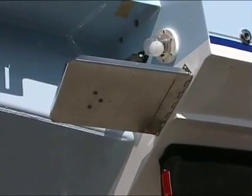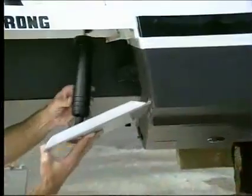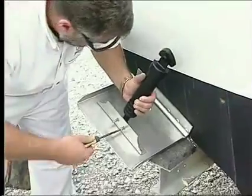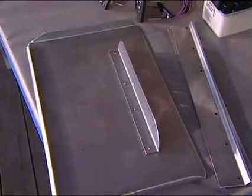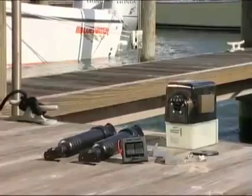Well, John, that's the trick when trying to size trim tabs for your boat. You're really looking at total surface area measured in square inches. So whether it's span or chord, you're looking for the largest trim tab you can comfortably fit on the back of that boat. Now, could I use your replacement kit on my current setup?